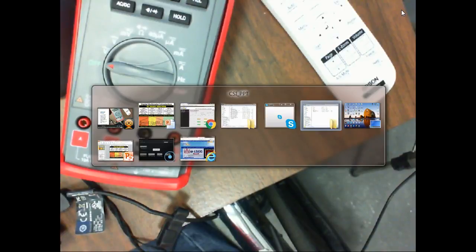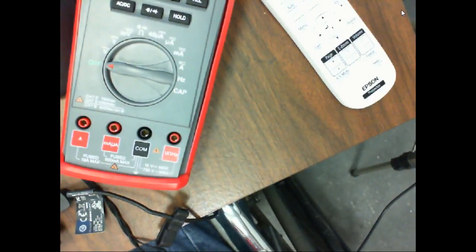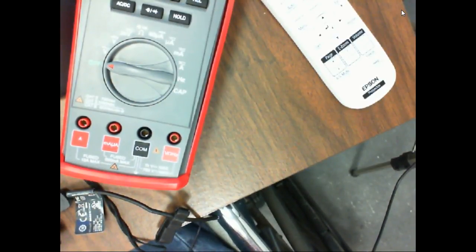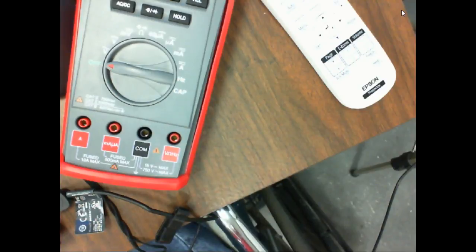And we'll see, we'll go up in a minute. Yeah, AC and DC. So AC up to 750, and then DC up to 1,000. And why is that? Well, a lot of people don't understand this is a surge, or a spike. What we read on our meter on AC is not actually what's there. Y'all understand why? If I'm measuring 120 volts RMS, I'm actually seeing about 340 volts peak to peak. So we're looking at this 170 volt peak, not the 120 effective voltage. That's what the meter's trying to block, right?